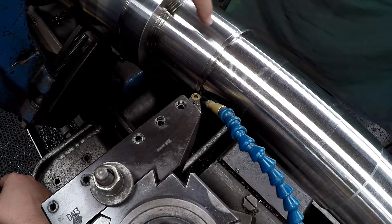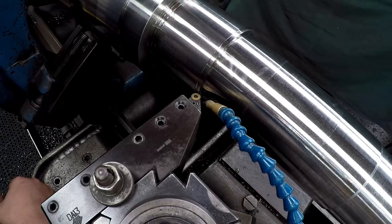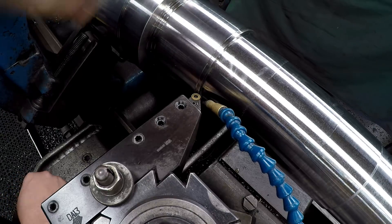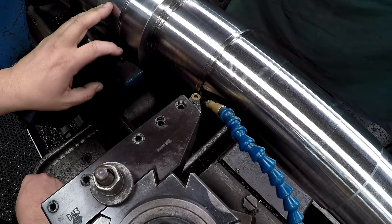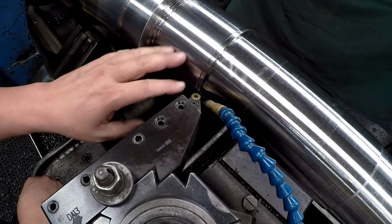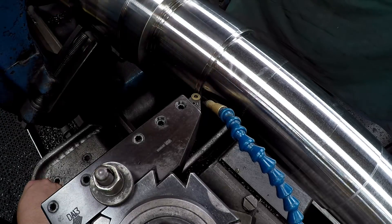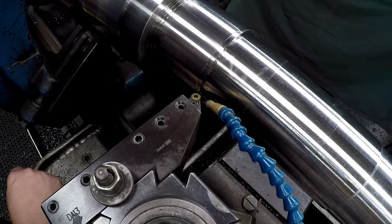I've got all these journals finished. I want to go ahead and put our radius here and here, so that's what I'm going to do. I'll show you some of that. This journal I went ahead and skimmed about 10 thousandths so it was perfectly true to hold the steady rest, because this large tool - anytime you're trying to do radiuses - it's prone to chatter. It will chatter going in there without some kind of steady rest. Let's get it cut.